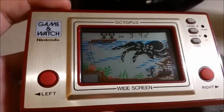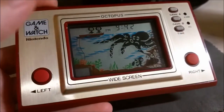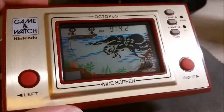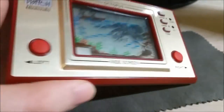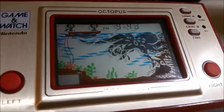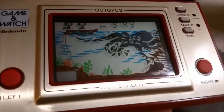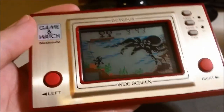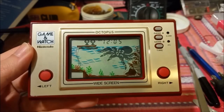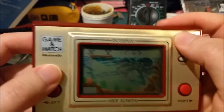Just a quick little addendum — you can see now the weird speckling on the LCD is completely gone. The only thing I did was reopen it and clean everything out thoroughly — the polarizing filter, the LCD, whatever. Additionally, I cleaned the battery contacts a little bit better than I had before, and you can definitely see the LCD is flawless now. I was a little worried there might be damage to the LCD that couldn't be fixed, but we're all good. Hopefully you guys enjoyed, and I will see you next time.